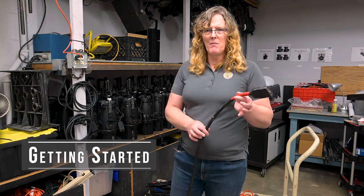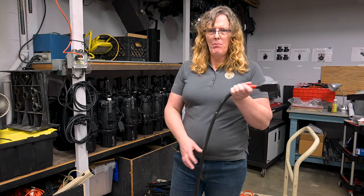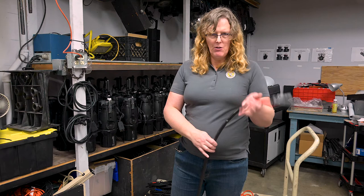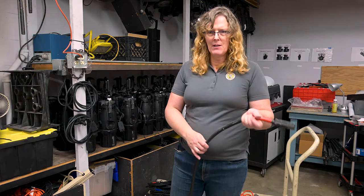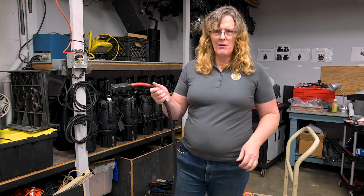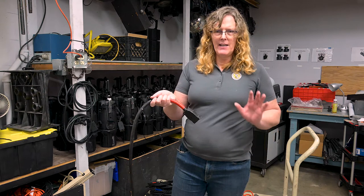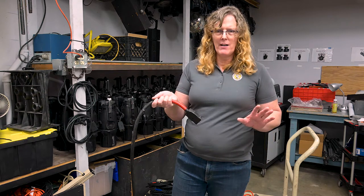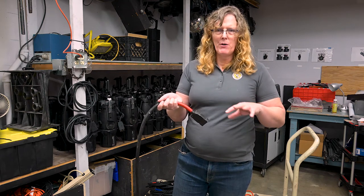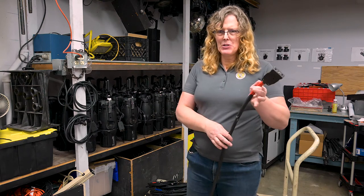This is going to show up in all of my coiling cable videos and coiling hoses and coiling ropes, but you need to pick a direction. You need to pick an orientation and a direction. You've got four choices. You can hold the cable in your hand like this, or you can hold the cable in your hand like this, or you can hold it in the right hand like that, or in the right hand like that. And every one of those four ways is going to require a slightly different technique, the same principles, but whether you're going one direction or the other. So I'm going to do it this way because I'm most comfortable with it.